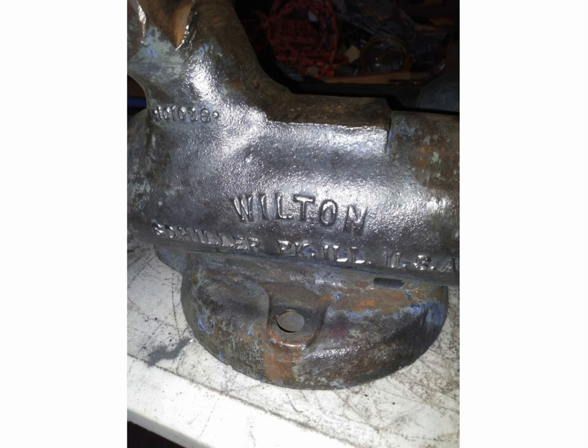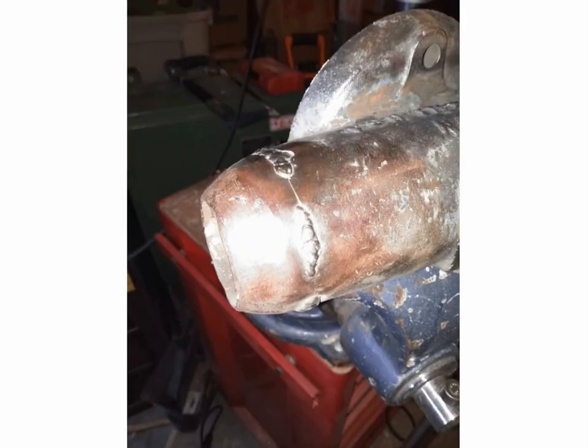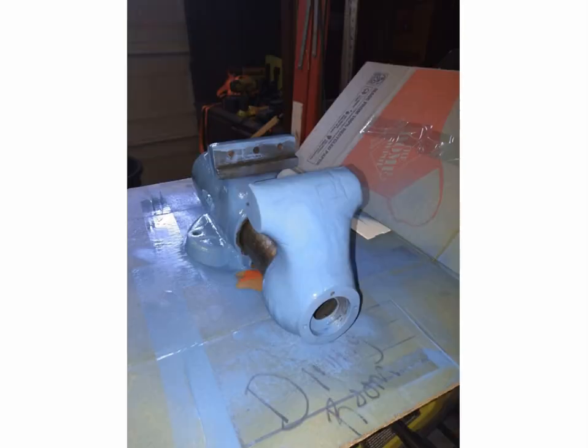There's the side getting mostly cleaned up. I just used a wire brush — I've used paint remover before and you still have to wire brush it afterward, so you might as well just wire brush it in the first place. Now I'm showing it where we're getting some paint on it. The sliding jaw has some very huge gouges in it as well; if I ground those completely away I would have had to grind a whole lot off and it wouldn't have been right. So I left those gouges in there.